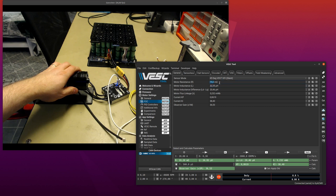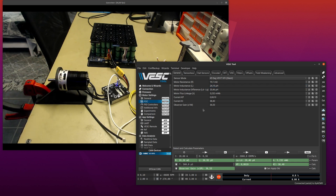The same thing happens if you are too low in inductance — if you go down to say 24, the same thing will happen. That means the inductance is a bit off, and sometimes the inductance measurement is not great, and if the Ld minus Lq inductance is low compared to the total then it's even more sensitive. So if you see that happening, try tweaking the inductance a bit until it works — my scooter had to decrease it a bit because it tends to overestimate inductance.